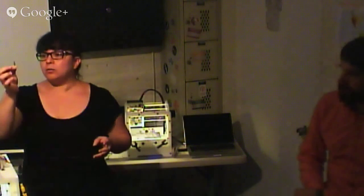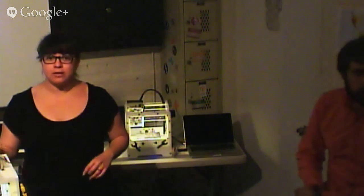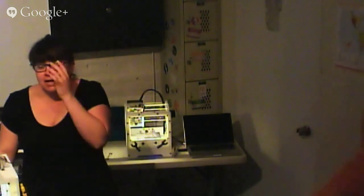And so it's kind of great, but this is a lot simpler, and it's a lot more fun, it's a lot easier. So, what type of bits does it take? Yeah. So today we have 1/32-inch bits, which are really small. We also gave you a bunch of bits with the machine, and it goes down to 1/1000th, which is really, really tiny, and not something I would recommend starting out on, because the bits are expensive and they break really easily. But they go down to really, really tiny. You can also get up to anything that fits an 1/8-inch shank, which is the part of the bit that goes in the collet, which holds the bit in place. Dremel tools, any Dremel tool will fit in the other one. So you can have a wire brush, you can polish stuff up, grinding cones, anything that goes in a Dremel.